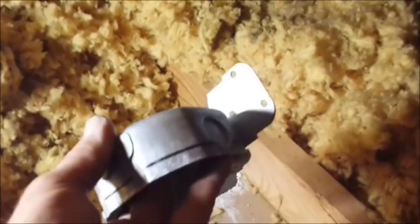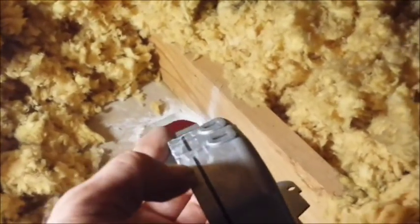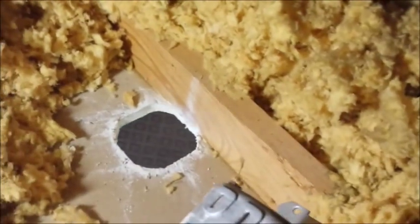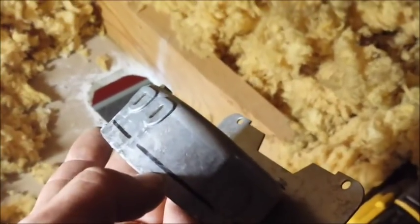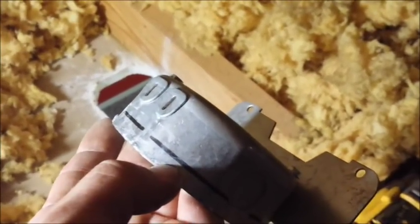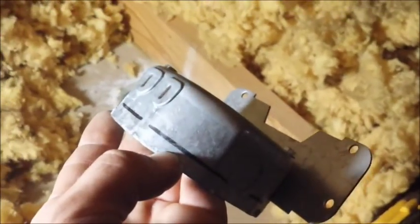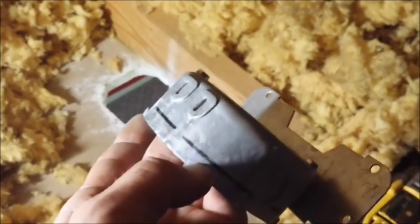Now what we're going to do is install our electrical box on top. I've taken the time to put a mark on here — that's three-eighths of an inch up from the bottom of the electrical box. We've got half-inch drywall. The reason I made it three-eighths is because I'd rather have that box just sticking up a little bit than to be hanging down below the surface of the drywall. That's going to make our fan hang down when we trim it out, and that's not going to look good. So three-eighths is a safer number — it gives us a little eighth-inch to play with.